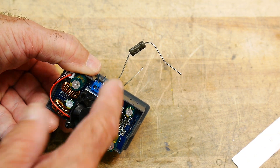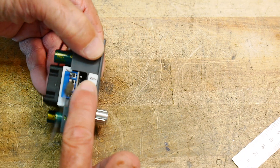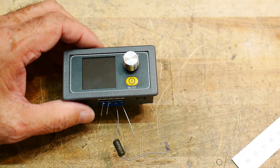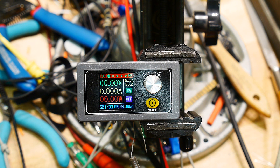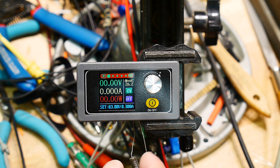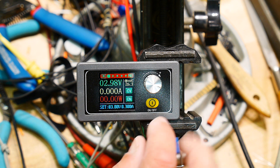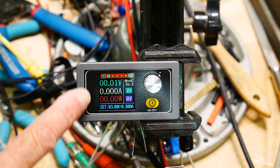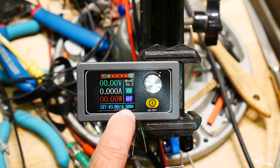I've been testing it — I have a load resistor with wires attached, and it's got voltage in and voltage out, plus and minus. Let's turn it on. It's got a really nice little display. I've just turned it on, so this is what you get: volts, amps, and watts. There's a little indicator for constant voltage mode that'll switch to constant current depending on the mode. You push the on/off button, it goes on, and it says it's in constant voltage mode with a green light. The set voltage shows at the bottom — it's set to 3 volts and a compliance of 0.3 amps.